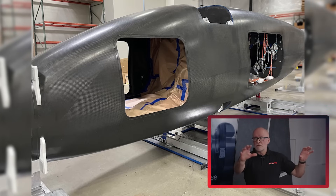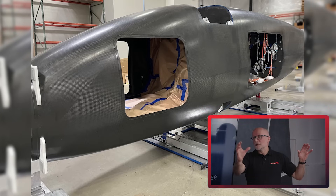With a composite as you're cutting — is it quite brittle as well? Well it's a laminate, so as you're cutting, if you're not careful you can spread the laminate, so you need to be able to keep the laminates together. And if you're drilling, the kind of holes we're producing, you want to produce the drilled and countersink hole in a single shot with good tool life, to very good size, in the perfect position — so a composite panel can come off and be replaced in minutes.